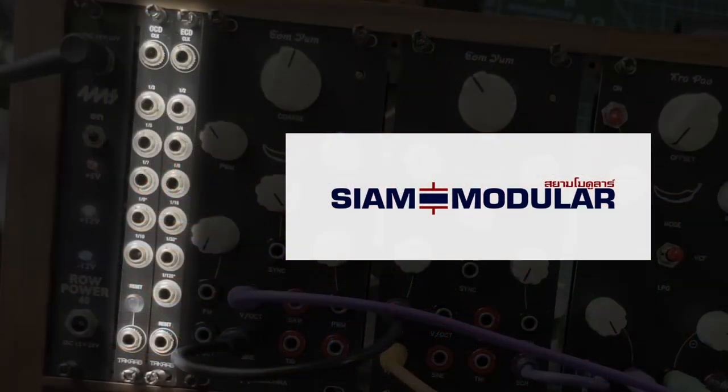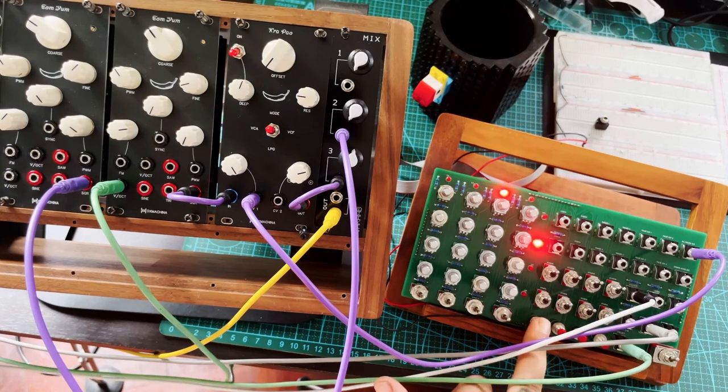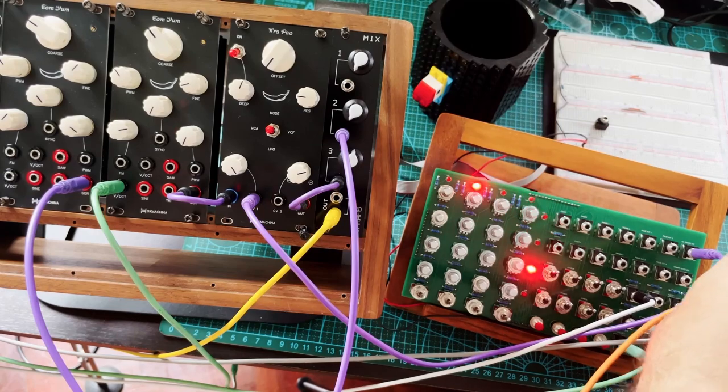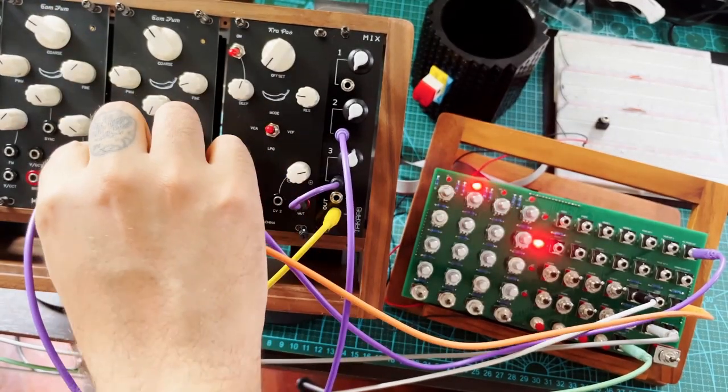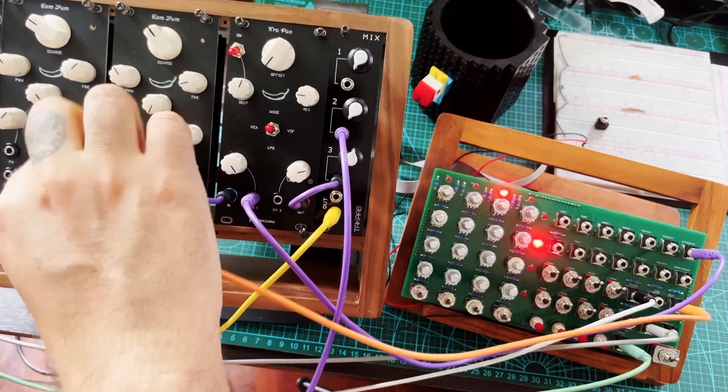I'm using these two fantastic modules by CM Modular. You can check them out on cmmodular.com. I will also leave a link below. Very useful 2HP clock dividers, odd and even, that take this sequencer totally to the next level. So here I patched an input to reset the vertical clocking. So now we have an 8-step sequencer. But if you remember, on the DCBA output, we have the second sequencer here as well. So in fact, we have two 8-step sequencers. So let's start by sequencing the first oscillator.